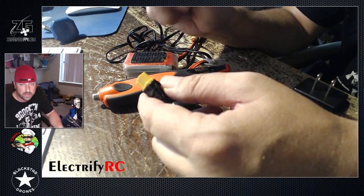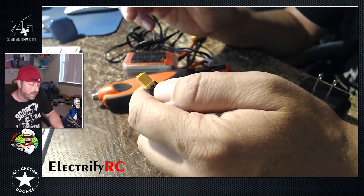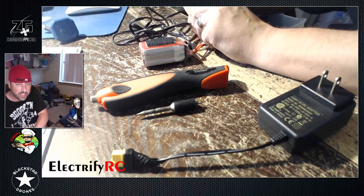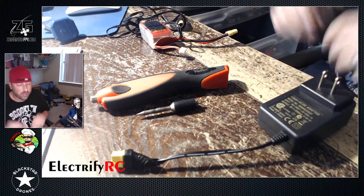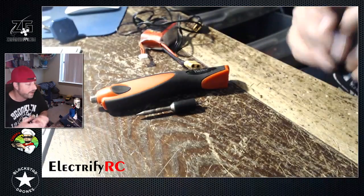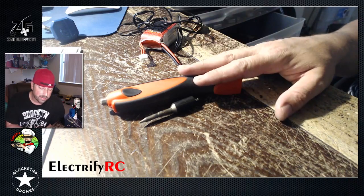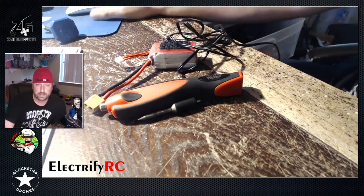What I did was plug this into the wall first, then use my voltmeter to check — inside the barrel was positive as normal, outside was negative. That's how I determined my wires. I then plugged them into the XT60 on the battery and checked the barrel again with them hooked up the way I thought they should be — sure enough they were. So then I soldered all the plugs on. There you go: how to turn a Weller WPS 18MP, or any 9- to 12-volt DC-operated hand solderer, into a field kit. Fly safe, fly smart.